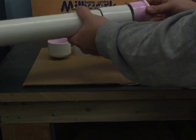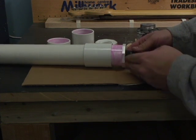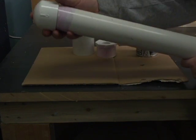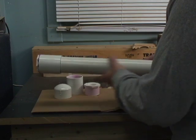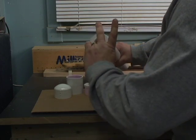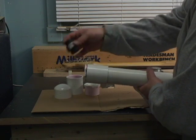This is then going to go on to the reducer. On the other side of your compression chamber we are going to glue this on now. We have glued this together — we have glued the coupling on, we have glued the compression chamber, which in this case is 18 inches long. You can see here the thread — we have not done anything with the thread yet, because we want that thread to go into one of these fittings, and we are going to Teflon tape that. We did not put the cap on yet because it is easier to drill first.